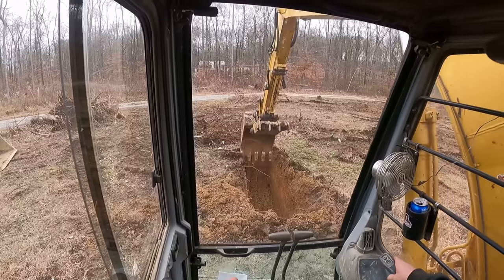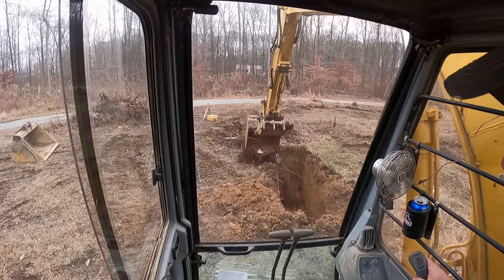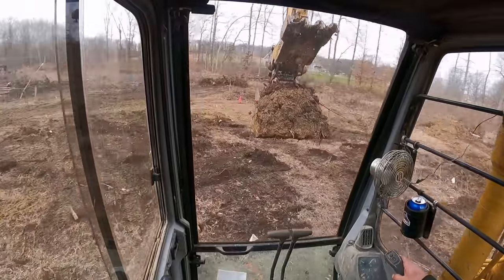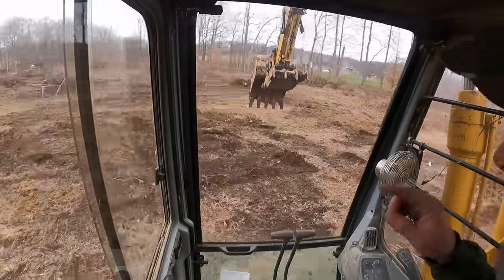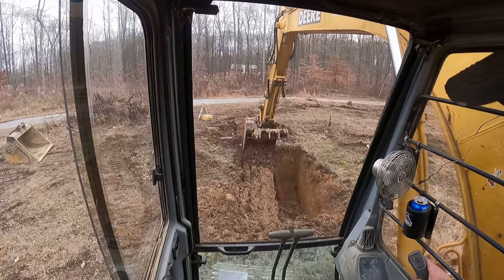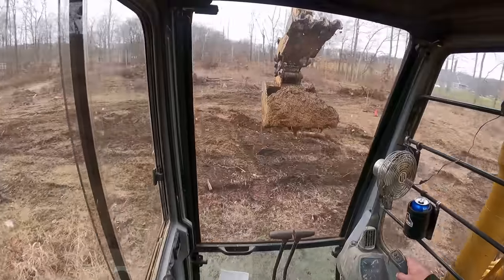There's our first line of the basement right there — it's actually degraded. I'm going to come back in here and dig a step or a terrace so you don't have to worry about this thing caving in on us. We're only about six feet deep, so I'm going to dig a three-foot wide terrace down about a foot and a half, two feet. Don't quote me on the exact rules because I'm not 100% familiar with them, but in most soils you're allowed to have a four-foot deep trench, and then you've got to offset back four feet and go again.